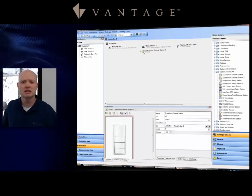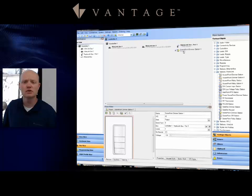For example, if I've got a scene point dimmer with all programming and load assignments taken care of, but something has happened to the station bus, and it has a companion that is Radio Link — I can take that device, drag it over into the antenna, and it will turn it into a scene point dimmer Radio Link that carries all of the programming, labels, and everything with it.